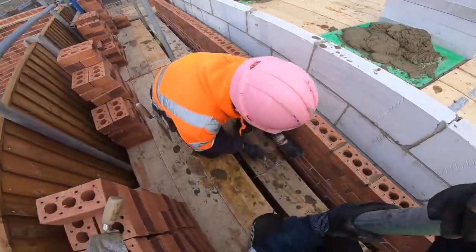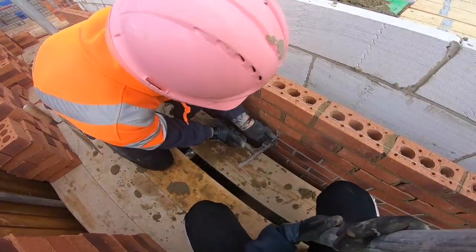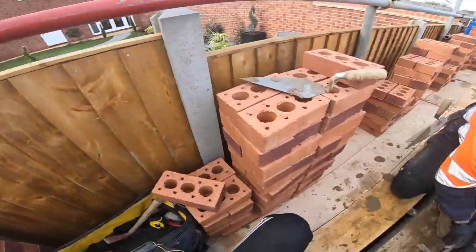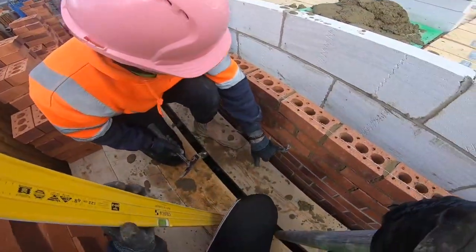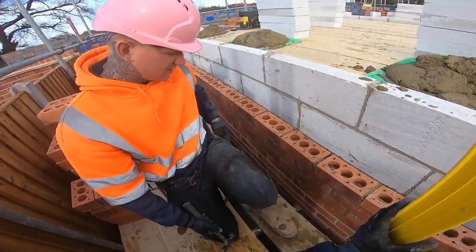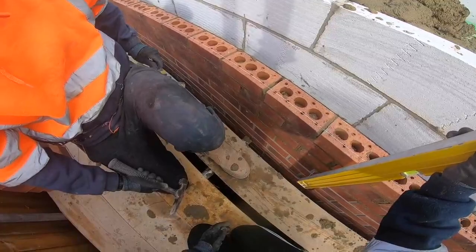Hold on, YouTube can't see you. Okay. So how do you remember? Yeah. Just to plumb from this one. Yeah, get my level. Yeah. Now do just plumb these ones and you go half bond to the other ones. But I'm not too sure about how I know to... you always get confused, so I'll just stick you two there, alright?